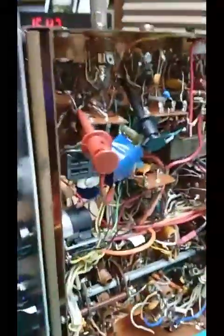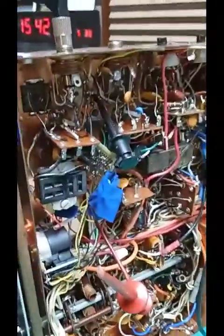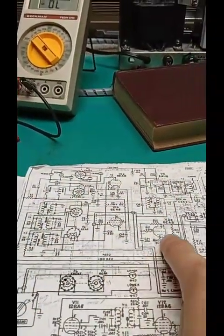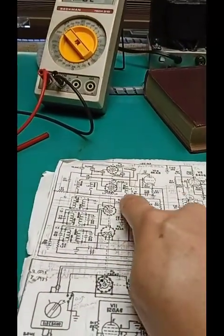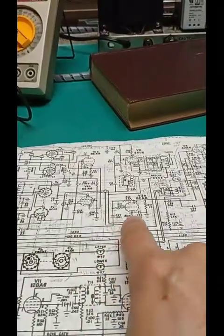Oh, no, no, no, no, no. No, not a bit. Take the alignment load off. Let the thing stabilize. Remember, all these circuits are coupled together. Everything in this upper left, all of this is coupled together and affected by adjusting that. Except that in 80, the oscillator isn't running. But this is coupling down here into the cathode follower. So give it time to stabilize and check it again.